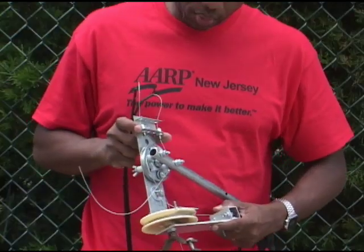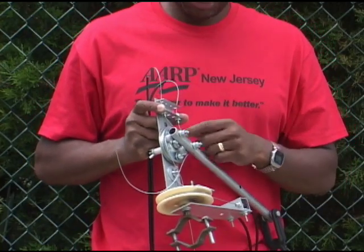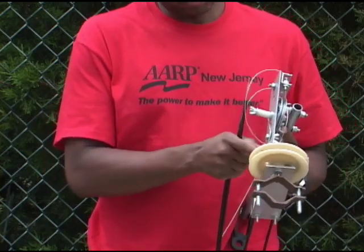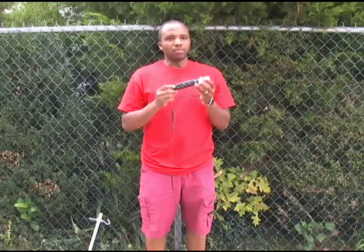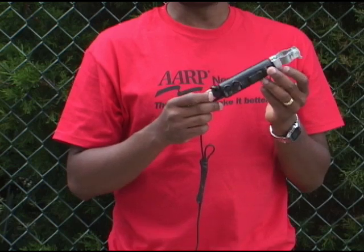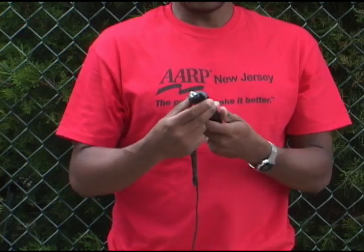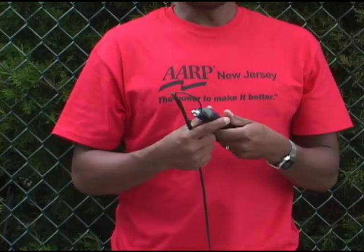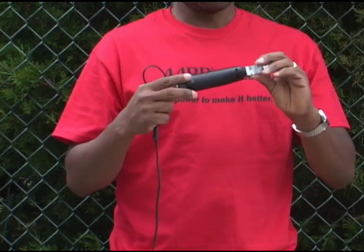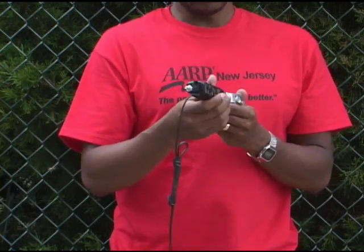This other wheel I got in the garage door fixtures section, and I bolted it on here. This is a zoom control I got from a whole Sony tripod I paid about $99 for six or seven years ago. I removed it from the tripod handle — it had a short cable, so I lengthened it to run the full length of the jib arm — and I ran a long bolt through this clamp so I can clamp it onto the crossbar, the same one where I put the weights for counterbalance.